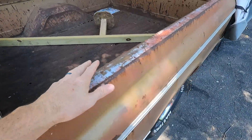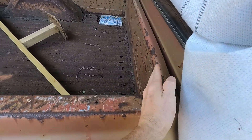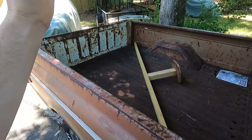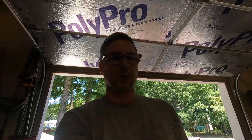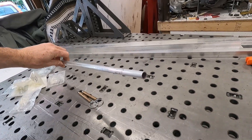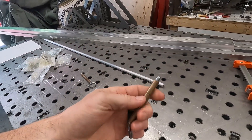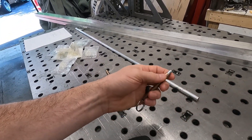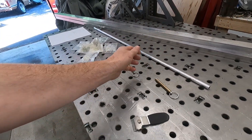The plan is to build an aluminum frame that comes up about a foot, and that's where our hinge portion will be. The whole back of the bed will hinge, and we're going to put gas shocks on it so it'll support itself when it's up, and also help keep it closed because it'll cam over once you close it. For the hinges, we're using this half inch rod with bushings inside, and these quick-release pins with a detent ball — one for each side.